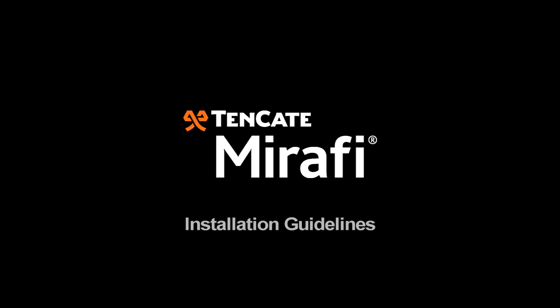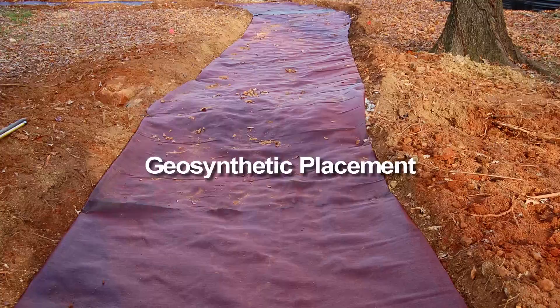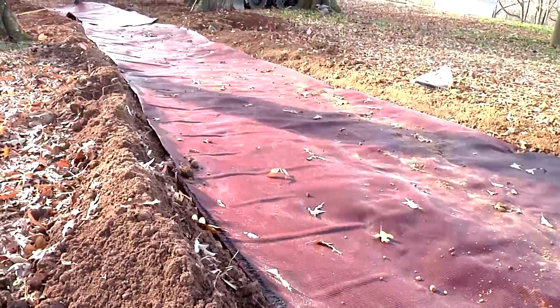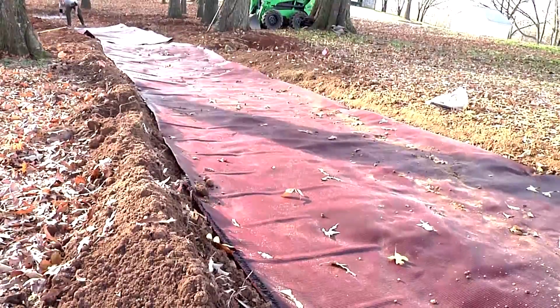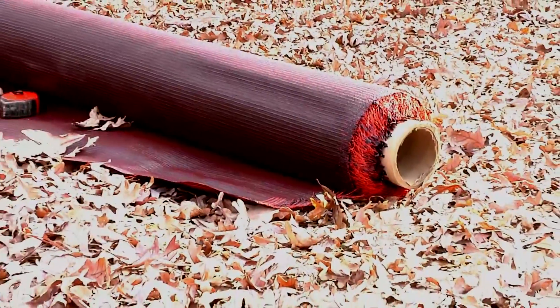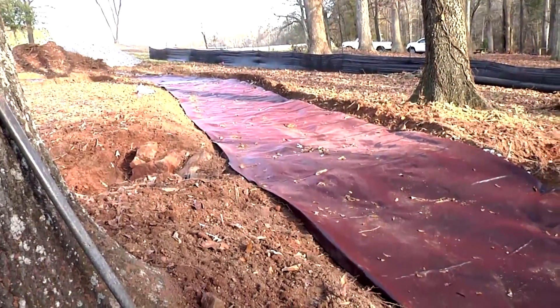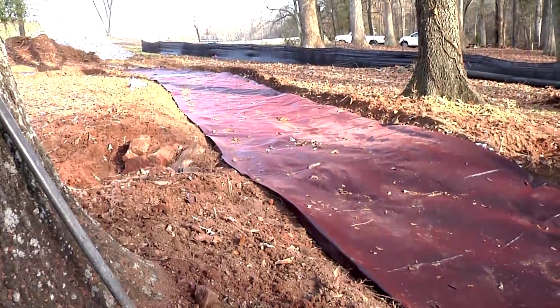The following took place on Day 3, Step 2: Geosynthetic Placement. Geosynthetics are designed to be placed directly on the prepared subgrade. The fabric should be rolled out flat and tight with no folds or wrinkles. Make sure to unroll the fabric in the direction of travel. The roll direction should be parallel with the centerline of the roadway pavement.